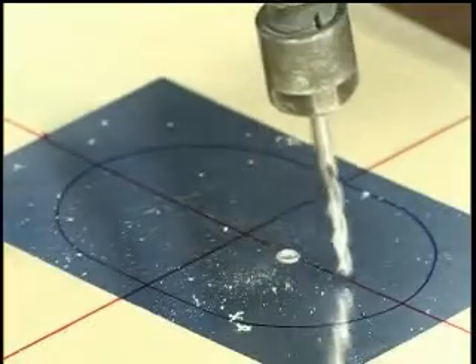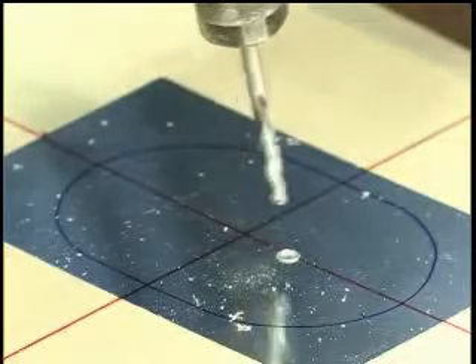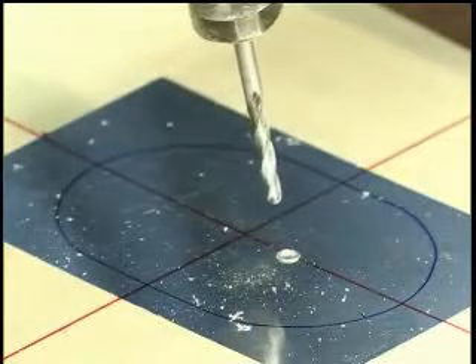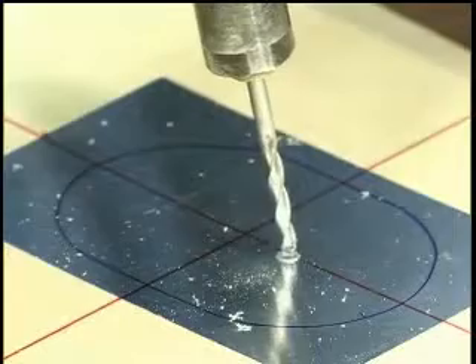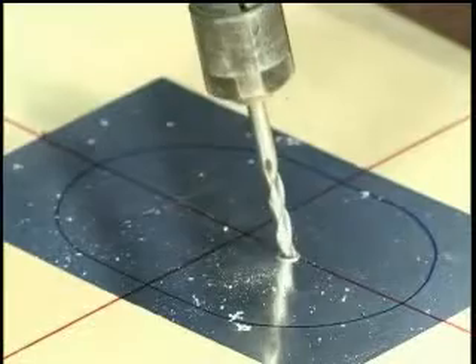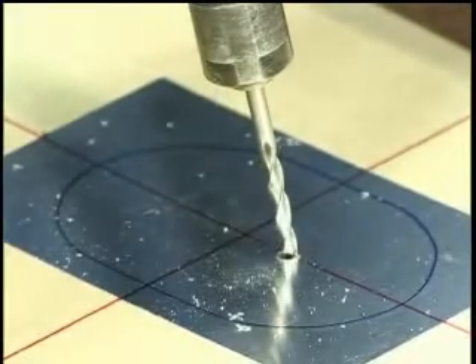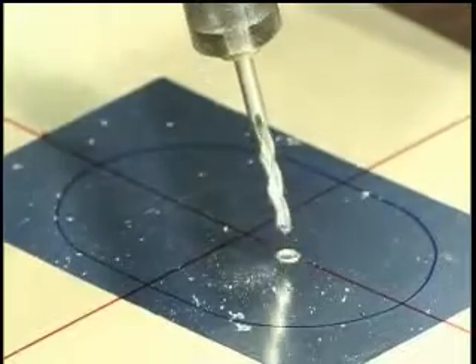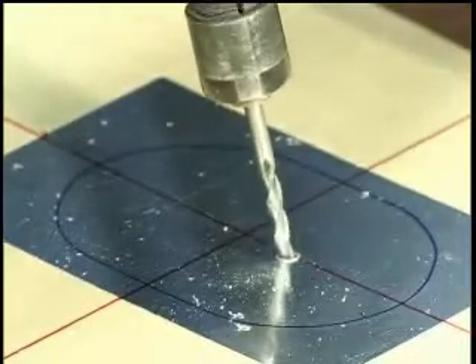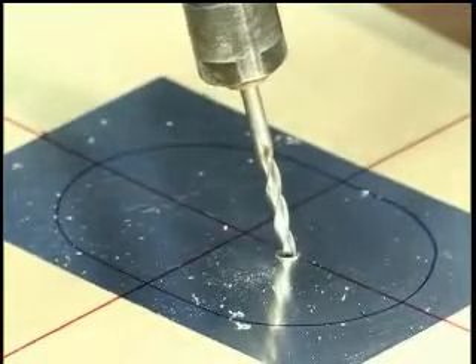I'm going to try and go forward along this red line and then come back down along the red lines, just trying to keep the cutting action nice and straight. You'll want to lean the tool slightly in the direction that you're traveling, and a slight up-and-down reciprocating motion would be even better. That reciprocating motion will help keep the flutes from getting too buried up.